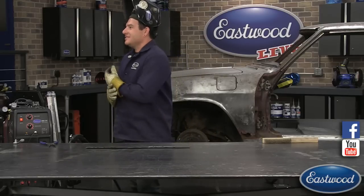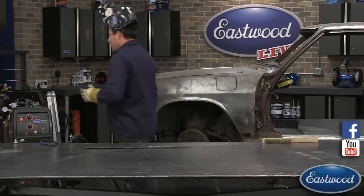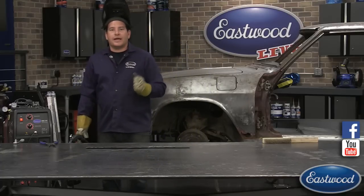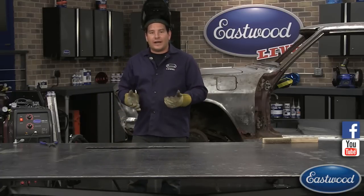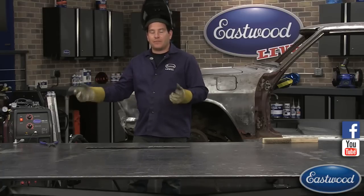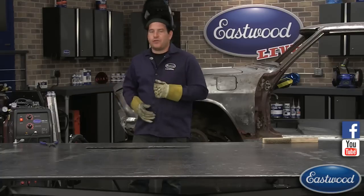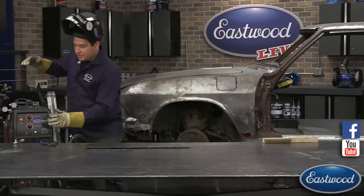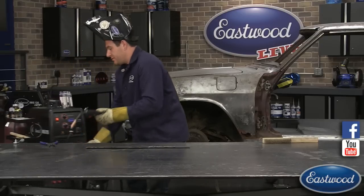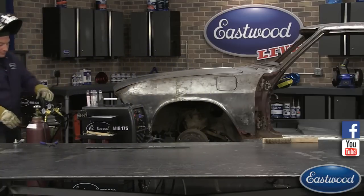And just one other question from Facebook was, what gas are you using for the MIG welding? Okay, so a good question. I kind of jumped over that, just because you had mentioned Flux-Core earlier. If you're using Flux-Core wire and you have your machine set up for Flux-Core, there's no gas required. You can just set your machine up, put your ground on, and you can weld. The bottles we have over here, I'm going to try and turn this so these guys can see what they're looking at on the bottle.